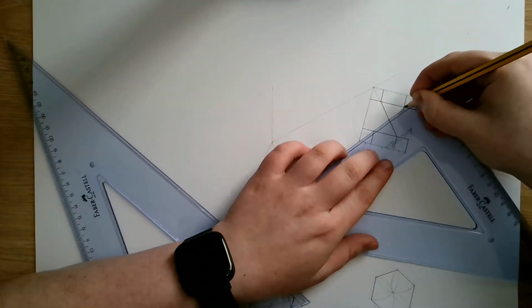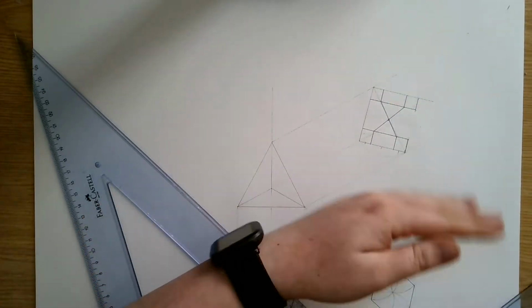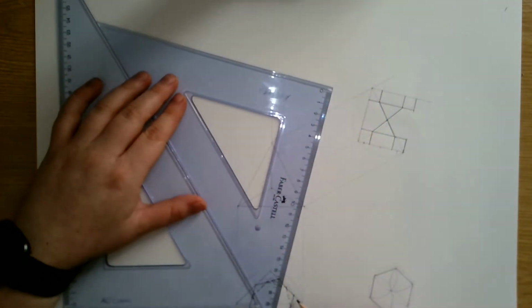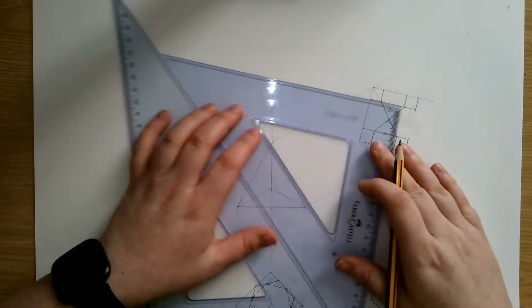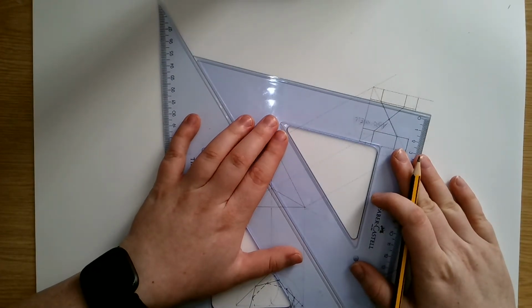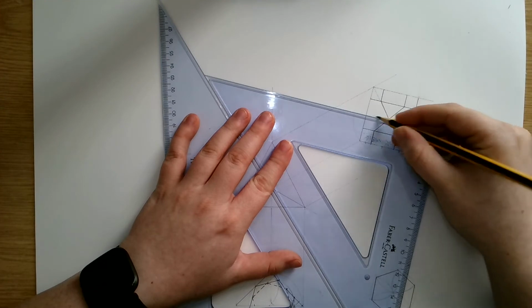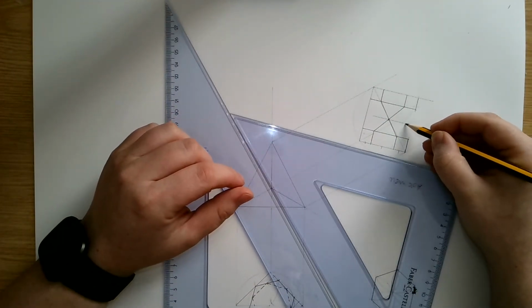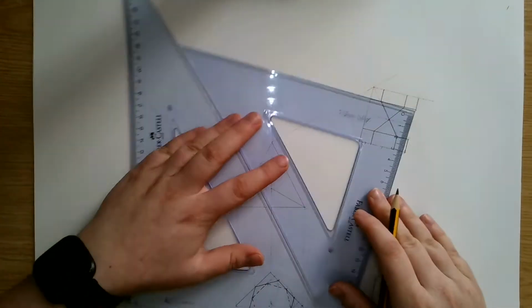And drawing from here to here as well. Okay. Now, remember those smaller distances you took a while ago? This is where they become important. You're going to need to draw a center line through that center point. You're also going to need to show off where that comes in, as far as where you get the information of where this line comes in diagonally to is that point here, which is your hidden detail down in your other view.